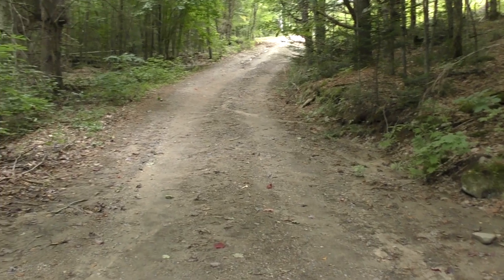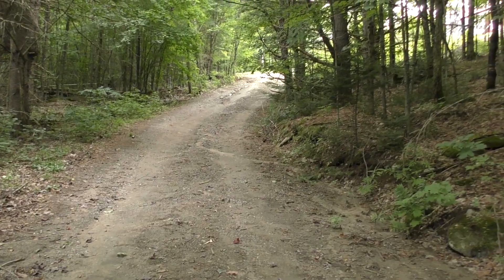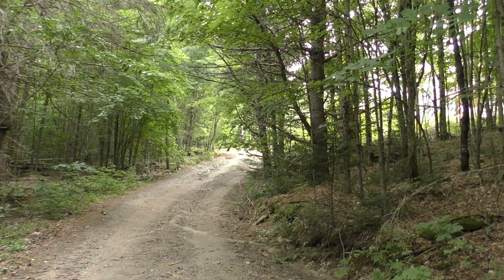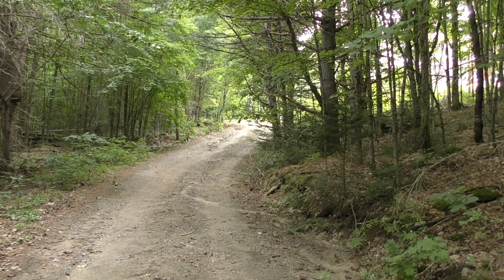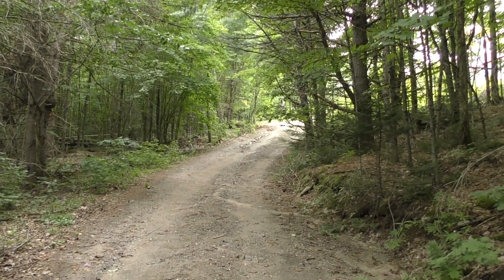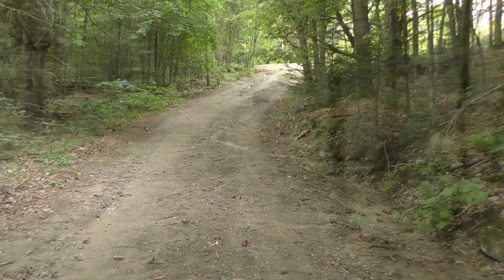I hope you found this helpful. Try doing some berms if you've got washouts like this on your driveway — it'll just keep on happening until you put a proper camber and direct that water away from the centre of the road or driveway or land or whatever it is you're trying to dry up. Just redirect that water and it will find its own path.